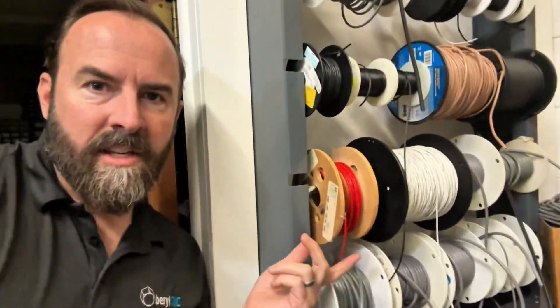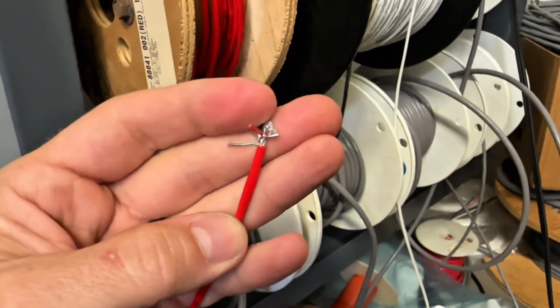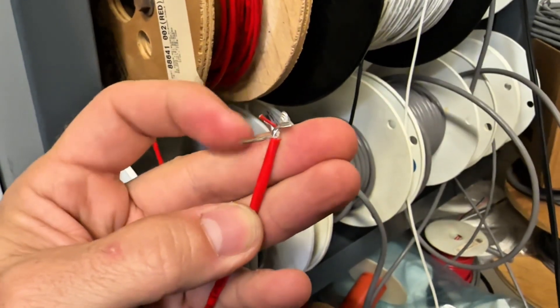I've got this awesome little corner of my shop with all of my cable rolls — some were purchased new for projects, others were purchased at HGR locally, which is like an industrial surplus place. What I really like is this red cable here — one, because it's red so I know which signal is going to those horns, but mainly because it's shielded. You can see what's inside the cable: we've got red and black 24-gauge wire and then the rest is shielding. I think I'd rather have like 18-gauge, but there's really not much current going to those, so this should be fine.